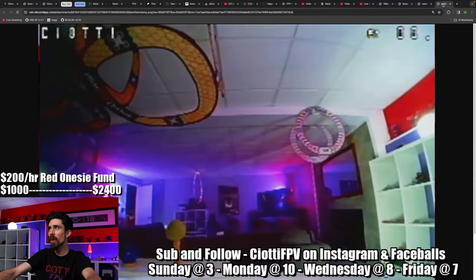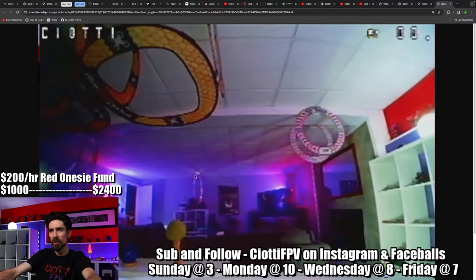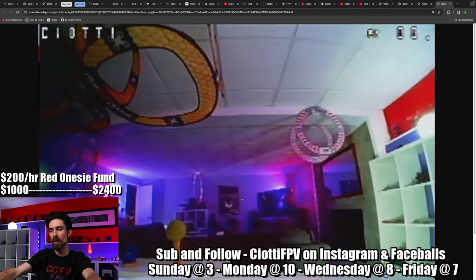Now we're going to compare the Caddx Ant Lite to the Runcam Nano. You know what's interesting? There's a huge difference. You can really see this gate here with the Caddx, and you can see it a lot less easily with the Nano 3. That is a contrast thing. This is a low contrast image here, and the Ant Lite has got a good amount of contrast. Again, the Ant Lite has the remote control, so I could hook it up and drop the contrast number way down to change that. This is a little too dark, I think. For me, it's still the Runcam Nano 3.